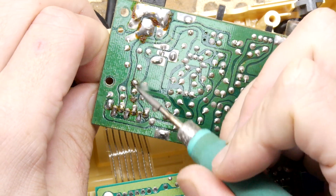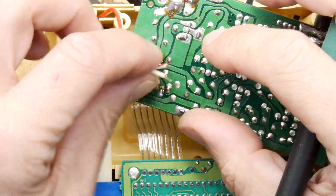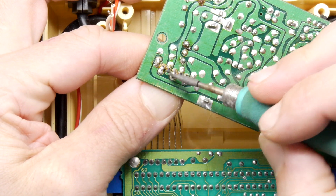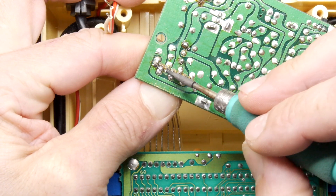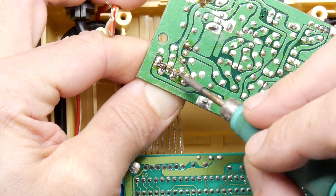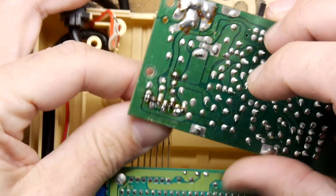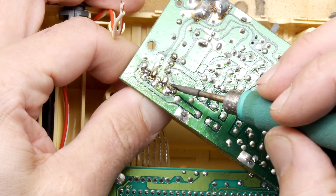So I'm just going between the power leads, one, the other, one, the other. I just kept the pins warm and I was able to extract that. Now the ribbon, you really don't want to dwell on because you don't want to destroy it too much. I can feel the ribbon moving slightly every time I do that. So just keep going in a line. I can feel the ribbon getting a bit warm. So I'm just going to let it cool down. You can see it underneath, it's starting to extract and pulling down on it all the time. But once it gets too warm, just stop because you don't want the insulation to melt because that'll make a whole mess of that cable.